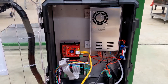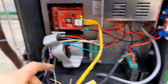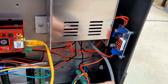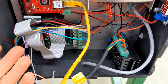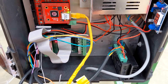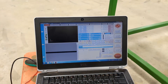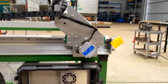I'm not really having much luck with all the wiring. I thought it was all going to be really easy, but I think I managed to burn down a 5-volt power supply from this module. I now put an external 5-volt supply, but I think this motor controller was just too much for it, although it should have been just 5-volt for a logic supply. I've managed to burn down quite a few things — more than I normally do. But now everything seems to be working again. I think the program has found the controller, and now it's time to see if I can get the X axis working.